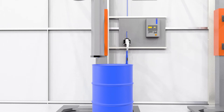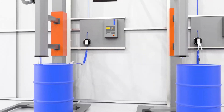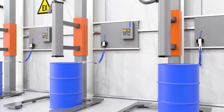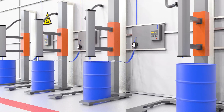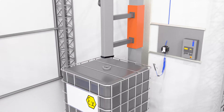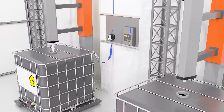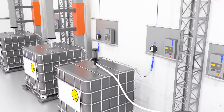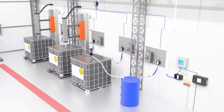When considering a product filling station, an ideal solution would be to have a remote indicator station mounted at each processing point, providing localized visual indication that the monitoring clamp has made a reliable connection to a verified ground of 10 ohms or less when connected to the vessel. It is important to achieve such a connection to ensure the grounding clamp has reliably penetrated any painted coatings, product deposits, rust or any other dissipation inhibitors which may prevent the monitoring clamp making a low resistance connection with the vessel.